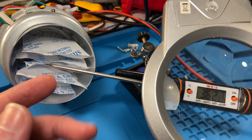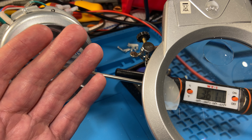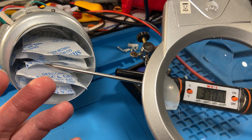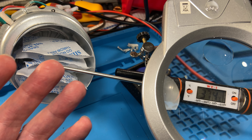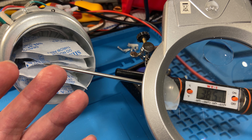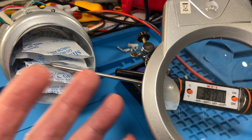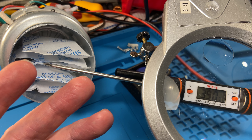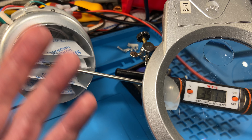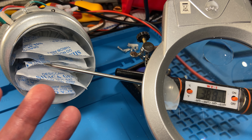You can see the temperature has come down to 36. It feels cooler, but when I had the fan running very slowly we were able to produce air of 60 degrees Celsius out of this. So that's our little talk on putting energy into air and how the amount of air you're heating affects the temperature of the air — a little demonstration.